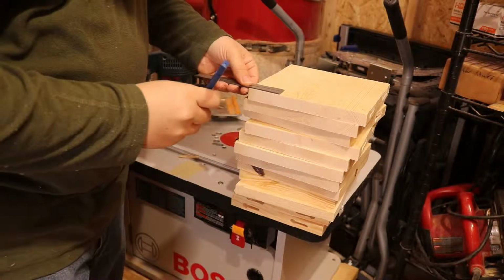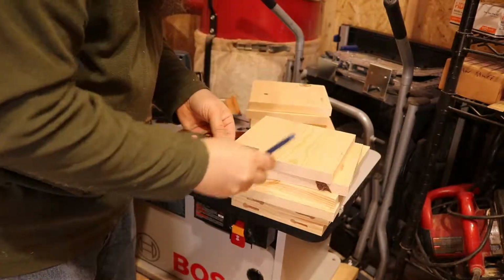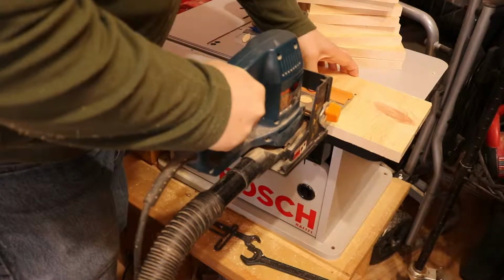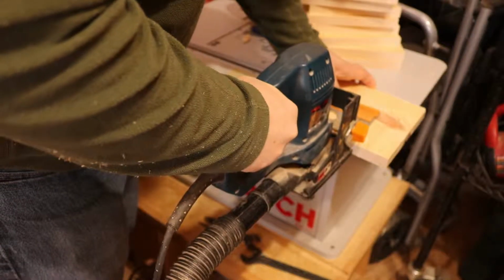I considered doing some fancier joinery, but I decided I would rather have the shelves done quickly, so I went for biscuits, which are quite strong and pretty quick to do. The shelves could just as easily be built with dowels or pocket hole screws, but I like the fully hidden joinery to go along with the fully hidden method of hanging.